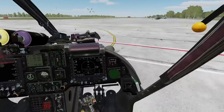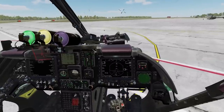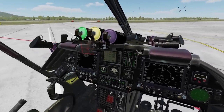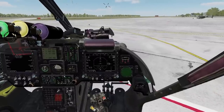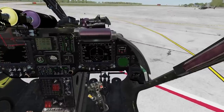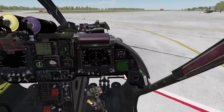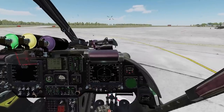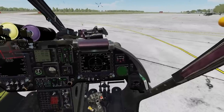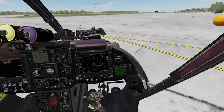The test environment has no wind, so it doesn't matter what direction we take off in. What I want to demonstrate is a minimum power takeoff — in-ground-effect hover power without touching the collective anymore. My control position is a little bit left and aft because we hover about eight to nine degrees nose high. Looking at my VSD, we're at about six to seven degrees, so there's variability across different CG configurations. I'm going to do a minimum power takeoff — just using the power required to maintain an in-ground-effect hover and transitioning forward.